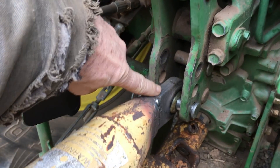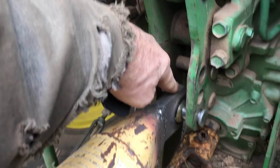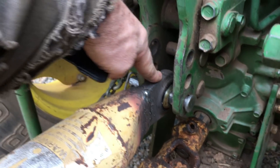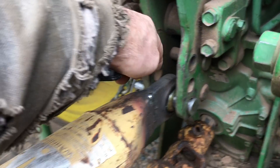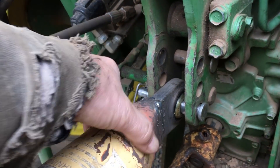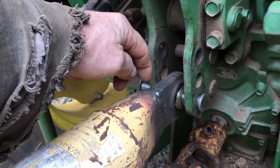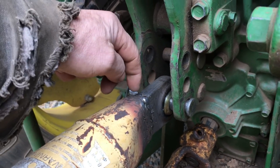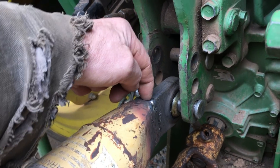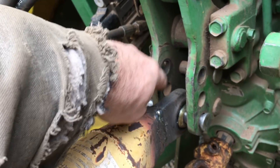So right down here is the top pivot. This end I just cut off and welded a new one on for a three-quarter inch pin. You can just buy this end piece — they're solid forged and you can just weld them in. Now this piece here is actually a squished-down, forged-down tube. So I was able to cut it back enough and open it up a little bit with some grinding, so I could slip that in there a tiny bit — about half an inch — and then weld it all in. So this came out real well.